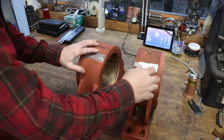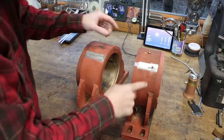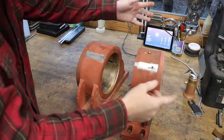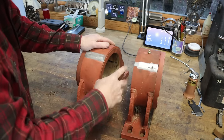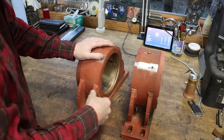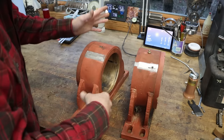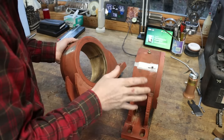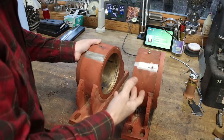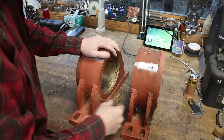Let me show you how I locked this bushing to the housing. And what I did is use two 10 by 1.5 millimeter set screws. Now you could key these, and me and the customer talked about it. He's a mechanical engineer himself. And we decided that this is probably the most cost effective and gonna be more than adequate to hold these